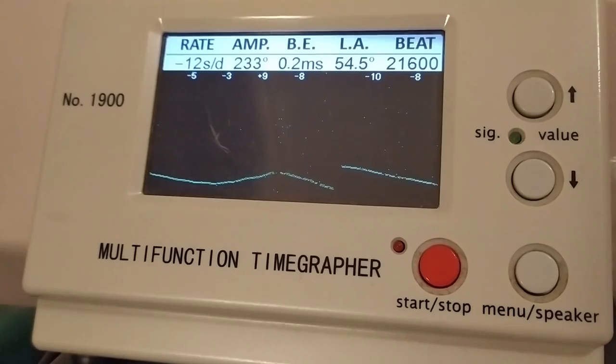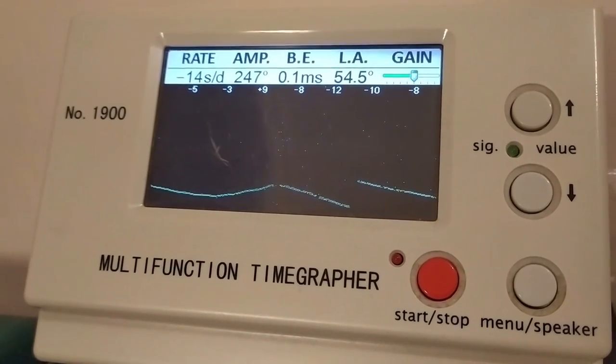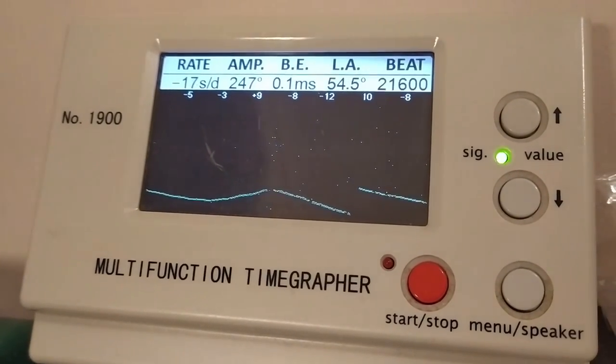In dial-up position, this doesn't happen. So what I'm going to do now is pop off the bezel and swap out the crystals and try that again. While I just have both crystals out, I'm going to take this opportunity to show the difference. Now you can see there, we've got the beveled edge, but most importantly, rather than a distinct edge internally, hopefully you can see this is actually just a curve. It's smooth right to the edge, like so.